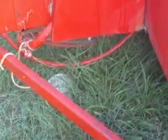I hope this helps. The last time I used this baler I broke my drive shaft — cracked it pretty good. I ain't got around to welding it up yet, but both sides got a good crack in it. I don't know if I'll run it this year or wait until next year. Either way, I hope this helps you out. The only way I could see you messing up on threading it would be if you were going above that piece there — then it could get in the way of the needles. When the needles come up it would catch your twine and kind of mess it up.